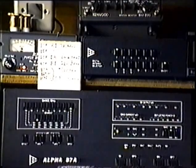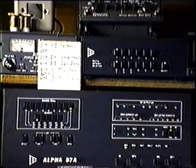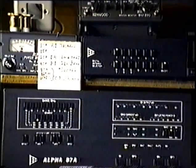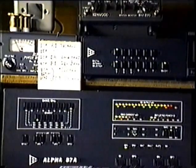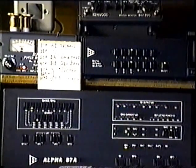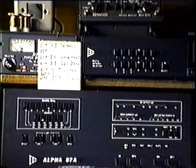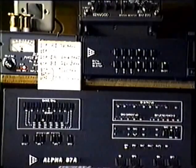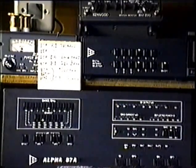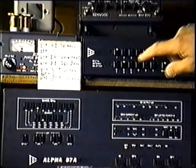If I've done this correctly, as I switch from one band to another, I'm going to leave the transceiver on sideband on VOX and switch from one end to the other. We should have a properly matched antenna at all points. This is 28 megahertz, 10 meters — we're on A1. Let's go to 80 meters — C3 is correct, the dummy load. 20 meters — that's D4, the big 20 meter Yagi. Let's go to 7 megs for B1, the 40 meter beam.